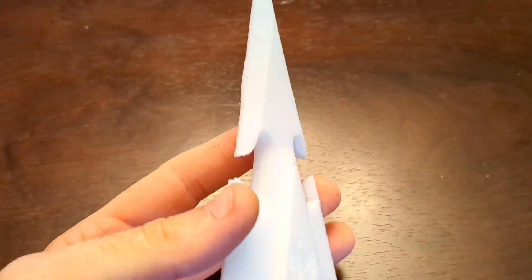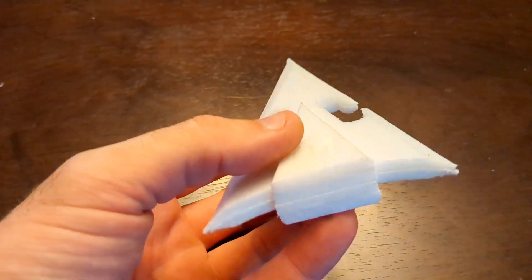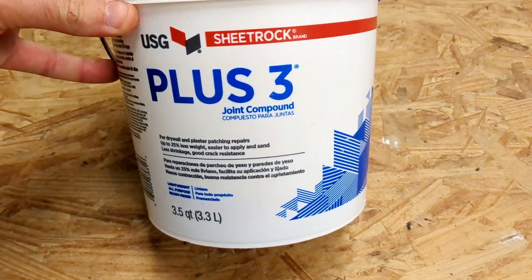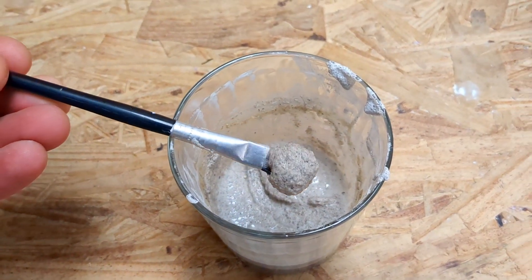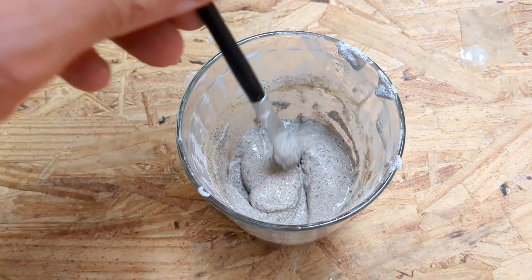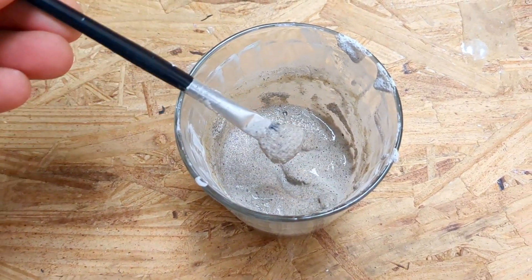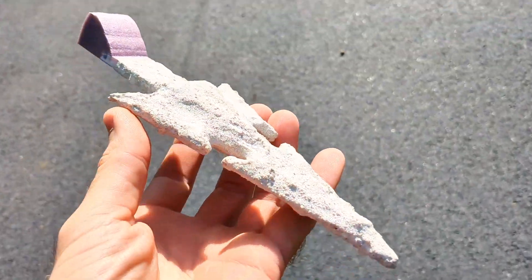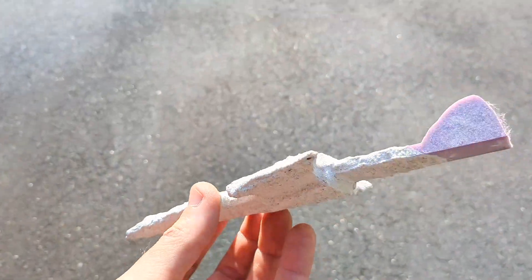All the pieces are glued together. I'm going to let this sit for 24 hours and then I'm going to glue a sprue onto the bottom — this is where the molten metal will flow into the pattern. After 24 hours and the glue has dried, it's time to add a coating to the foam pattern. I mixed some household wall plaster with water and then added some sand to the mix. This will give it a harder shell and contain most of the molten metal. I let the coating sit for about 48 hours to let all the moisture evaporate out.